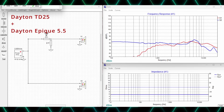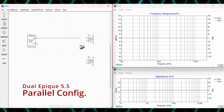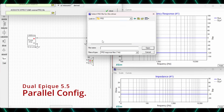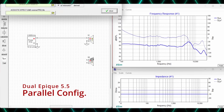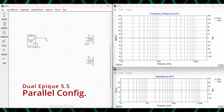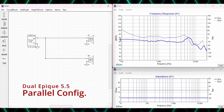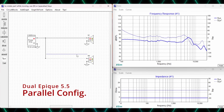This gives us the most flexibility for the complex stage of crossover design. Looking at our hi-fi woofer example again, if we add another woofer in parallel, this will halve our impedance and increase efficiency by 3 dB. Sensitivity and efficiency are not the same thing, but for this purpose we can see that adding a second woofer in parallel gives us 3 dB more output. We can use this parallel driver configuration to our advantage with inefficient drivers, giving a traditional inefficient hi-fi speaker greater dynamics.